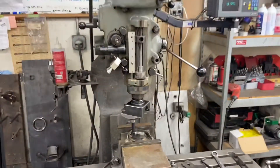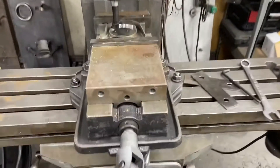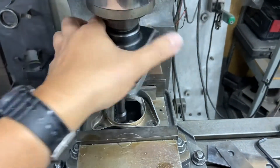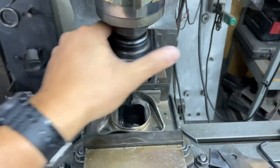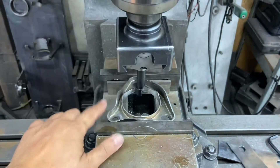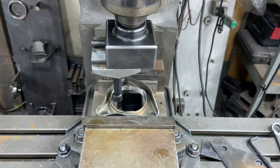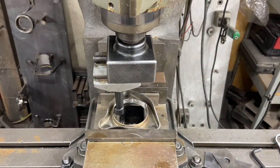At this point I figured I should just stop and set it up on a vertical mill. I took the time to index it so the cutter is as close as possible to center. I'm going to cut off a little bit at a time until the pipe fits over.